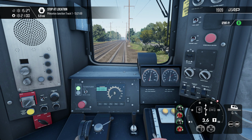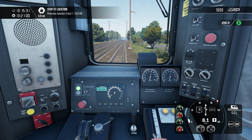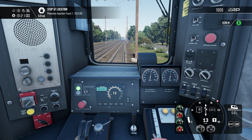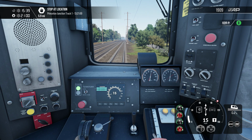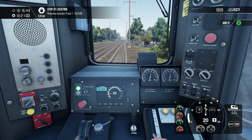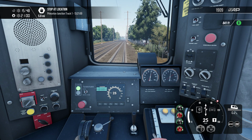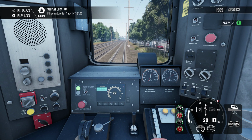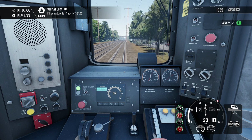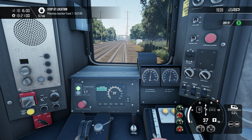Okay, Princeton Junction next, just under 6 miles. Once again, that's another fast stop, so get prepared to apply the brakes nice and early. Alright, Princeton Junction. The stop guide for Princeton Junction says, take a brake application at the second CIL box after CP Clark, if doing track speed. Take 15 pounds and then take an additional 5 to 10 pounds at the third CIL box if needed.